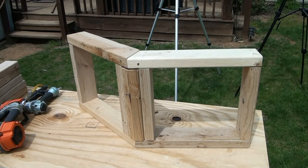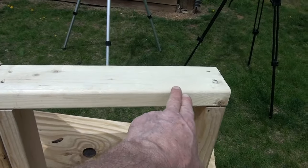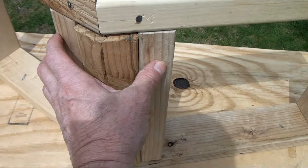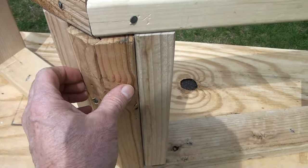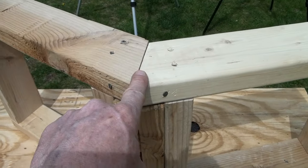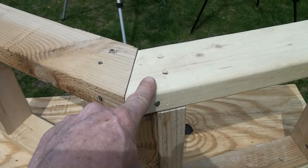Here's a typical outside corner display that I put together before I turned the camera on. You can see our wall comes straight down and turns and goes on a 45, and we've got built into the corner here — the outside corner of this 45 — solid blocking. These pieces are custom cut and inserted in there, and that's what I'm going to show you how to do in this video, and also how to cut your plates so that they form at the apex a 45 degree angle, because these are not 45 degree cuts on the ends of these pieces.